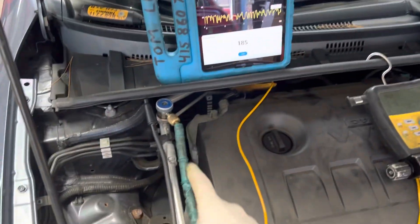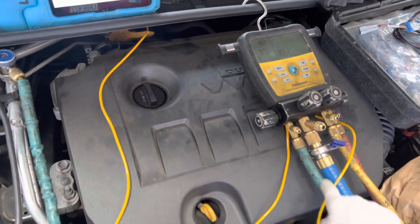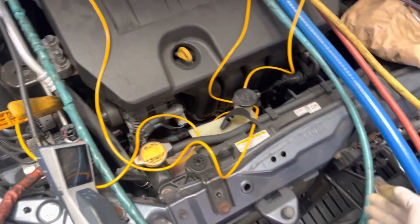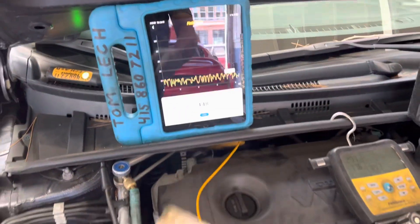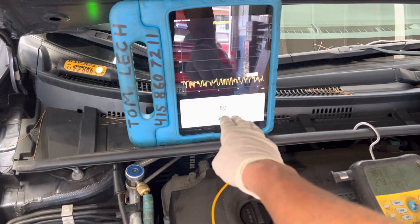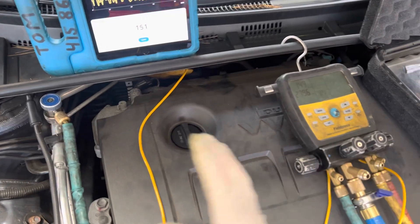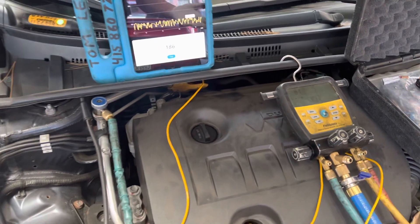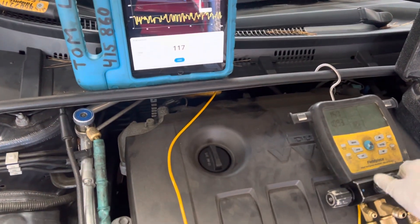Now I'm going to turn off the source of vacuum. We'll just have the hoses on there, and you get contamination from your hoses because rubber hoses outgas moisture and refrigerant that's trapped in them because you use them all the time. So they are a source of contaminant that'll actually make your pressure decay go up higher. You're not supposed to use refrigerant hoses, but something's better than nothing. It's only automotive — we're not in commercial refrigeration. This is not a cryogenic unit or a home residential unit.